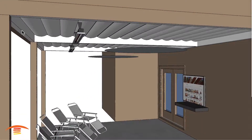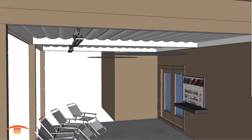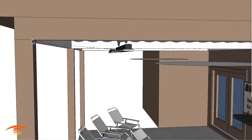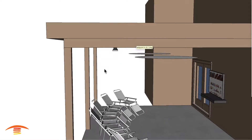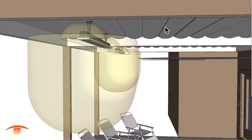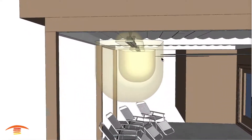If you were to place the heaters over here, you would have to place them on the underside here because this height is not high enough. I need six inches of clearance above the heater because of the possibility of combustible items right above the aluminum surface. What I did is place the heaters approximately two feet ten off of that edge to the center of the heater, which is going to give us a really good footprint of heat. I am approximately 18 inches off of the edge of the fan, so that won't be an issue. That's the most important part — that we're meeting those clearances.